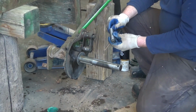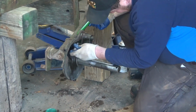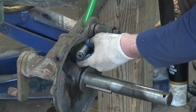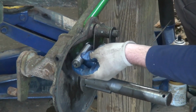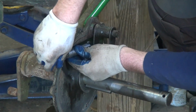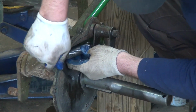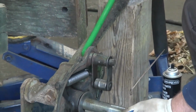So when you put our lever return spring on, first there's a little hook back here. You can sort of slip it right around our lever. And if everything works right on a nice day, there we go, it just slips right over the top. We take our bolt and simply thread it into our spring. Just like a brand new one.